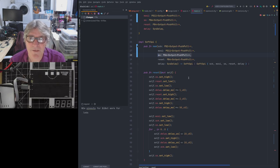However, I have another pin in there which we use for events and interrupts, which is a way for the ICE40 to notify the STM32 that it needs attention, i.e. that it's got data or something's changed in the QSPI conversation. In the interrupt scenario, it pulls down the interrupt. The STM32 then examines a particular address to find out what the root of that was, and then services that interrupt. So you could use it as a kind of interrupt control, like a PIC. And you could build the PIC into the logic of the ICE40.